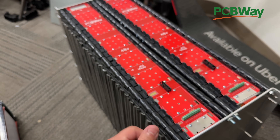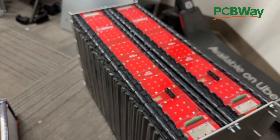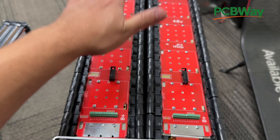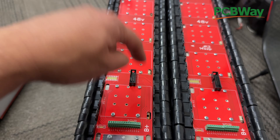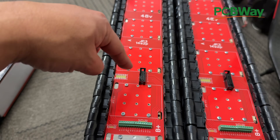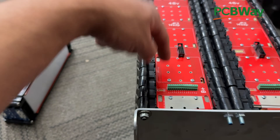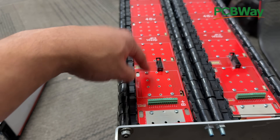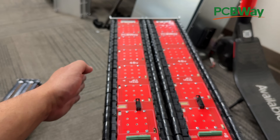They're two in parallel and 14 in series. This board right here allows you to very easily put it on top of the existing bus bars, then put screws through it — self-tappers that tap right into the copper and aluminum bus bar. It's a bi-metal bus bar. Then by mechanical force you sandwich the cell tabs in there. That's how you build your 48 volt modules.